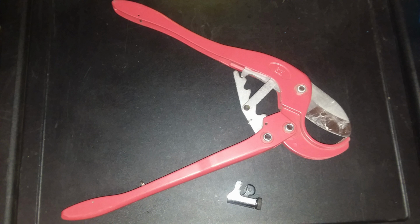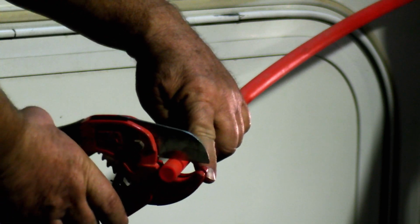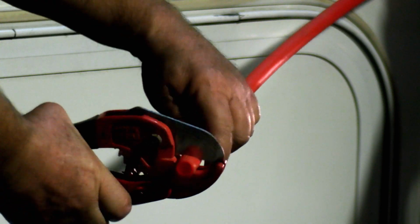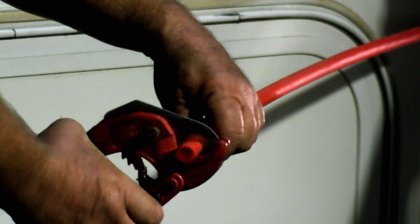The plastic pipe cutter uses a sharp blade like pruning shears have, but you shouldn't use pruning shears to cut a pipe. This cutter works well with sprinkler pipe, PEX tubing, rubber or vinyl hose. It leaves no burrs on the cut edges. It's very fast, and it's easier to get a square end on the pipe with this tool. This is important for PEX tubing and some hoses because without a square end, it will leak at the connections.